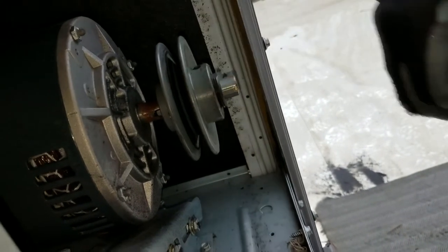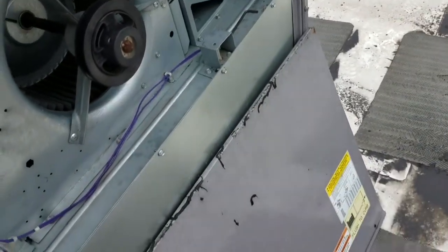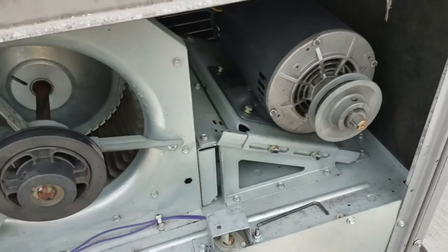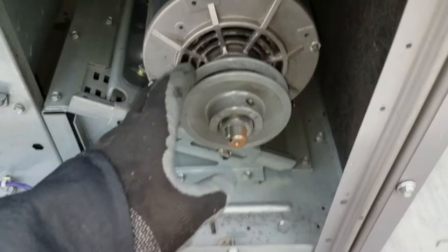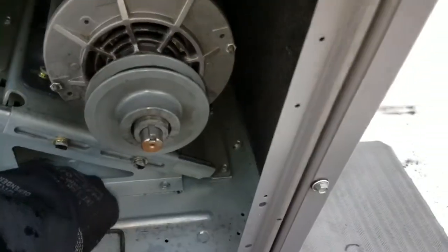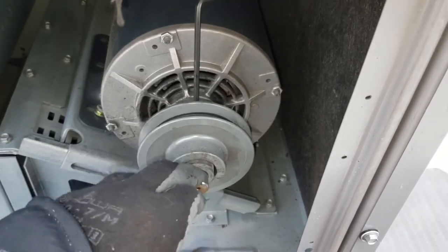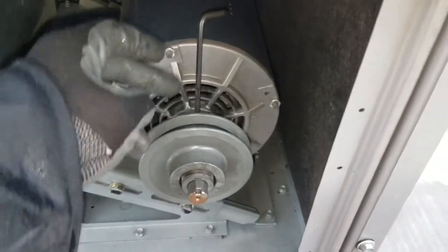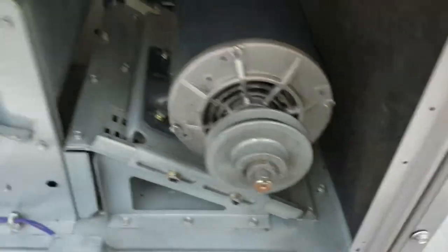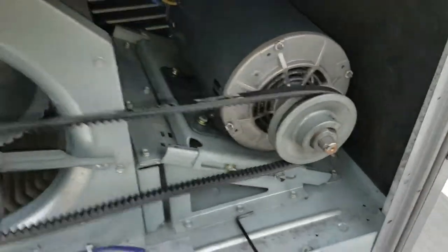I'll check by sticking my head in there, then show you how to fix it. It turns out it was almost perfectly aligned, which means before it wasn't okay. So we've got the flat spot I mentioned, and then we have a pin. On the back side of the pin, there's another set screw, and it's supposed to set down right on the pin. If you need to adjust it, loosen that screw and pull it in or out wherever you need to go, then adjust it back down on the pin and get it pretty tight — otherwise it can unspin itself.